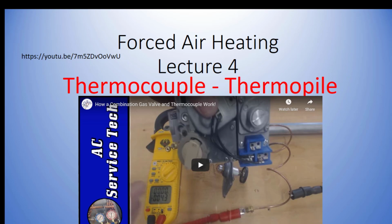So when you push it in, you light it, and it starts to generate a small amount of DC voltage. It creates inductance. So there's a coil inside of here, okay, with many, many wraps, and when that's sufficiently lit, it provides enough voltage to create enough inductance, enough magnetism, to hold that open. And as long as that flame is lit, it's generating, and it'll hold that open until the flame gets blown out. It could be blown out from wind, or it could be loss of gas supply, things like that.